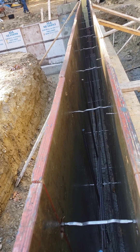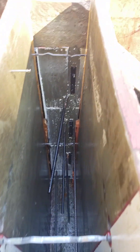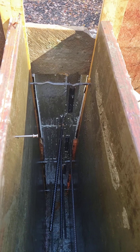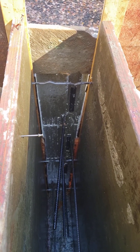This is an eight-inch concrete frost wall for the garage. We typically do ten inches around here, but eight inches because it's just a single-story two-car garage. Anyway, let's go back to the studio and I'll break out the details so we can talk about this connection in a little more detail.